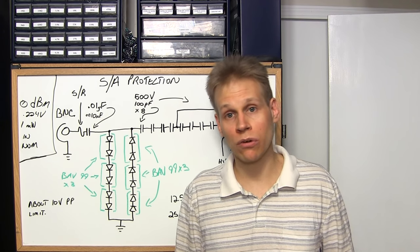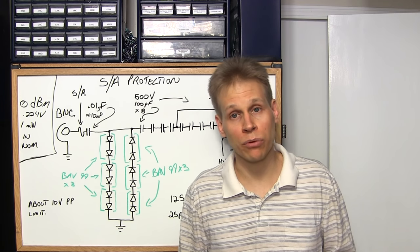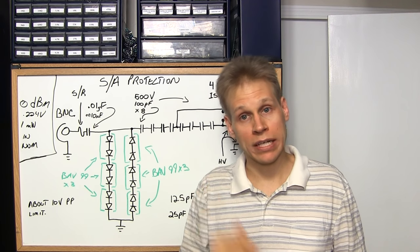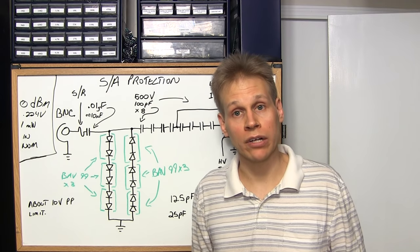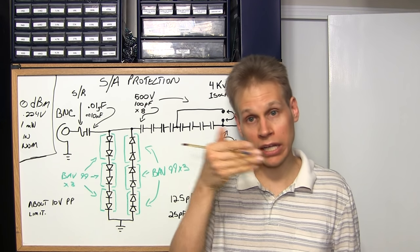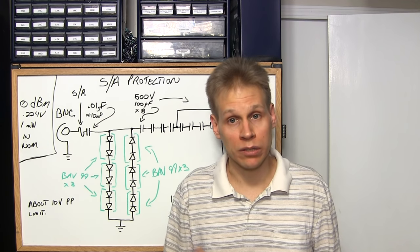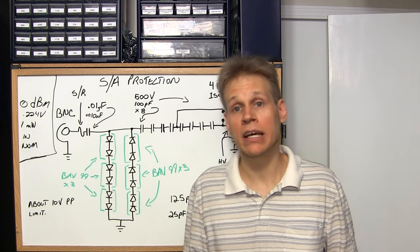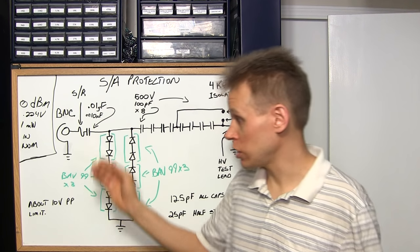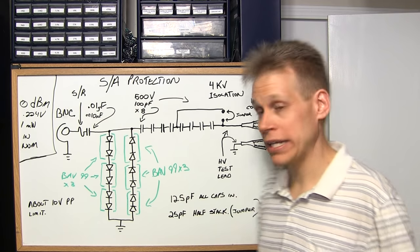This here is a little strain relief. BNC connectors with lots of mileage on them — the center conductor sometimes gets a little bit loose and that tears up traces on circuit boards. So this is just a little kink of wire that allows strain relief; if it gets loose it'll just break the wire and not wreck the little circuit inside. I suggest that whenever you build anything with a BNC connector, unless it's soldered directly to FR4 board, add strain relief. This final capacitor is 0.01 microfarad, 50 volt rated.